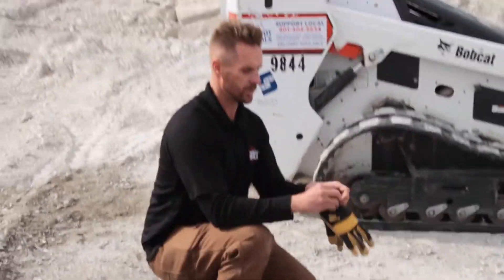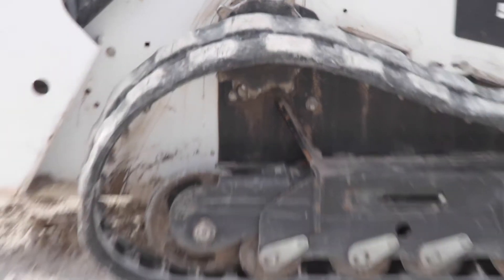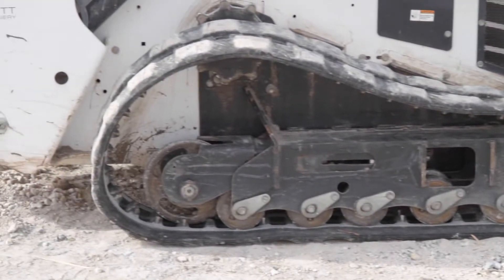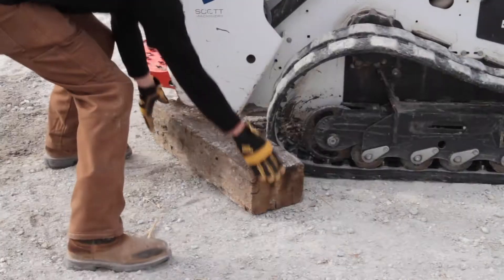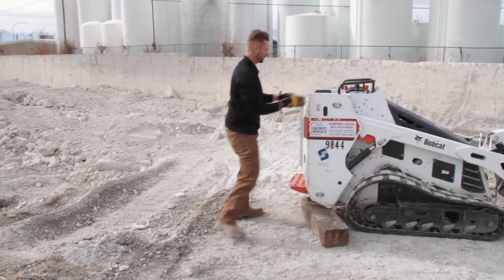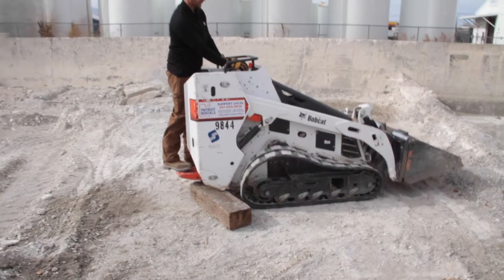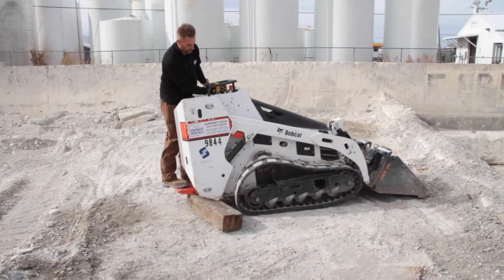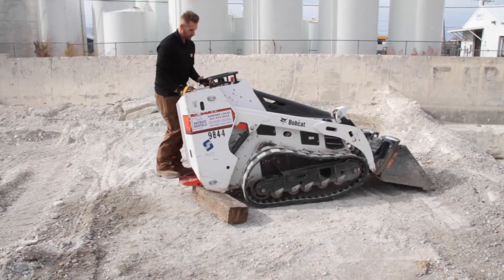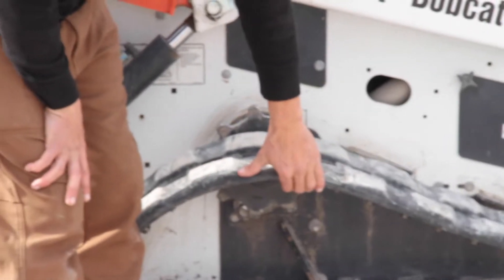I always like to wear gloves because I don't want to bust my knuckles or my hands — it's just better to wear gloves. Your first step: go ahead and turn the machine on. You can use a stump, a block; if you have a lift, use a lift. We're going to move this right underneath the corner, as you can see. That's going to give me my wedge in the back. I'm going to hop on the machine and relieve all the pressure so that my track is hanging. See how it's hanging? I'm able to work with it.